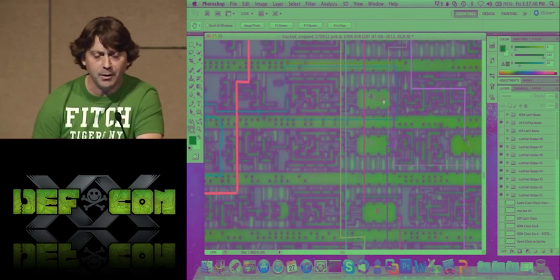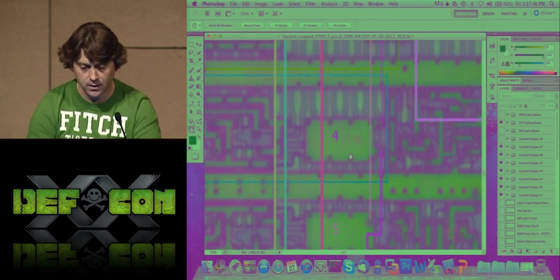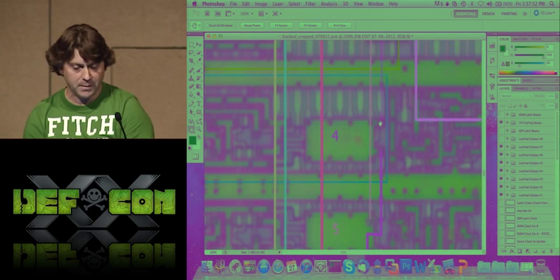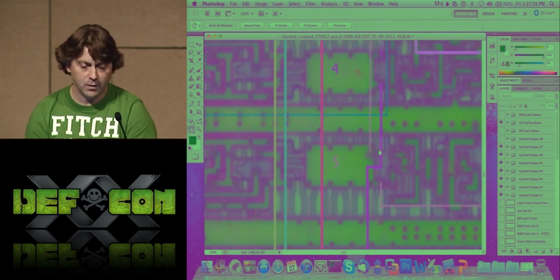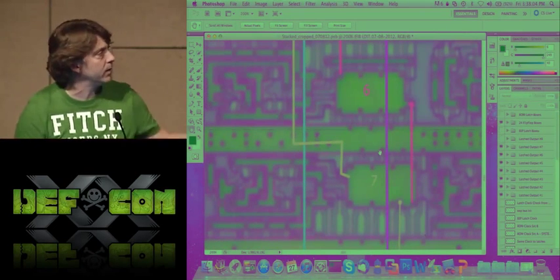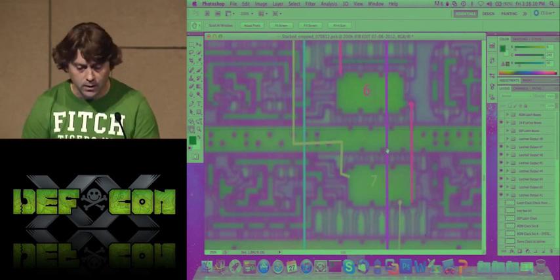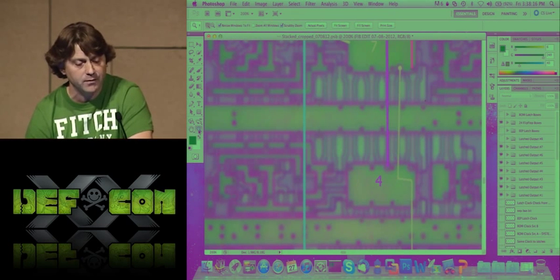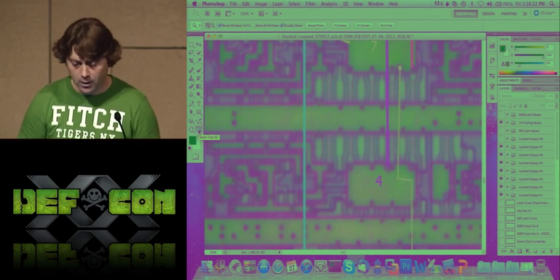And then here's that game I was talking about. So look at the plate on number 4 right here. Number 4's plate, it's getting a little fuzzy. I'm too zoomed in, but you can see there was a via where my mouse is here that went up, and then there was a via here, and then it went down. And so if we follow this blue wire right here, and I don't want to turn the layers on and off because it gets confusing to everybody, but the blue wire is following where the routing had gone. And then boom, look at that, it connects into another one. So this is what I was saying before. Now you've seen 2 different tri-statable output drivers for bit 4, my pseudo bit 4, to be determined.